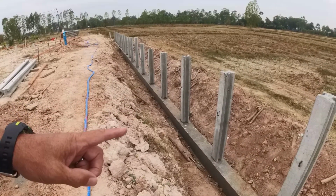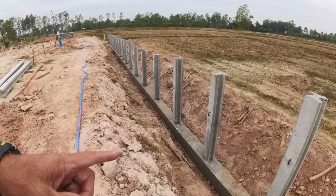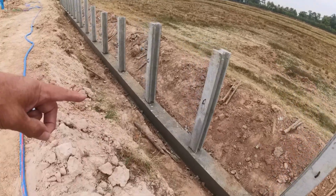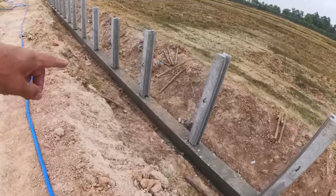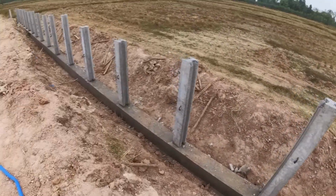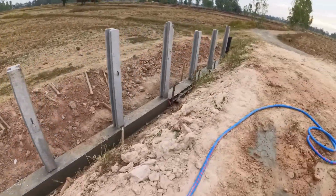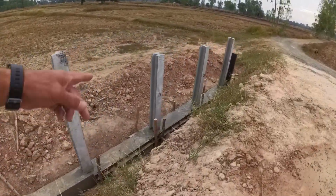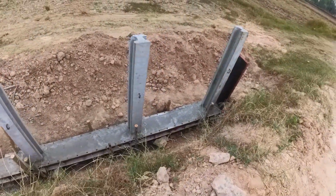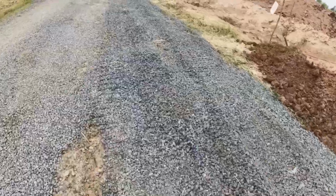And one thing I will say about wet tie concrete and a vibrator, look at the air pockets in that wall. Almost zero. Couple right there at the bottom of that post. But this thing is good compaction. Oh, also, they did get the rest of this hand filled yesterday, so these forms will come off today. Still got some rock left here.